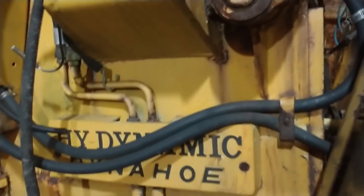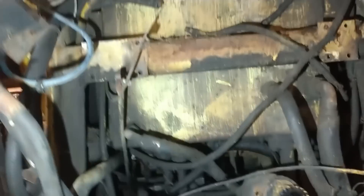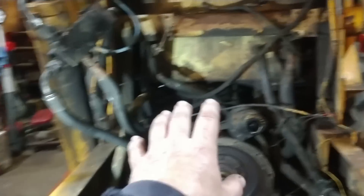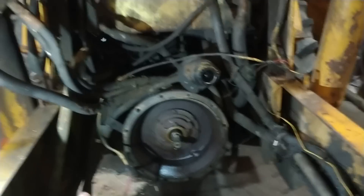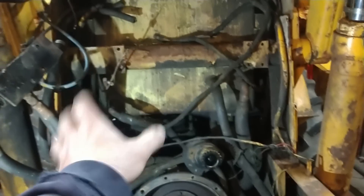The next thing is we have to contend with this leak — you can see the sawdust down here. That hydraulic leak is right back in behind here underneath the floor and it's very difficult to get to. The transmission's in the way — both of them — and it's not going to be real simple to take care of. So I'm going to go ahead and take the opportunity to take the transmission out. We're going to take the shuttle shift, or reverse, or whatever you'd like to call it, and also the manual transmission.